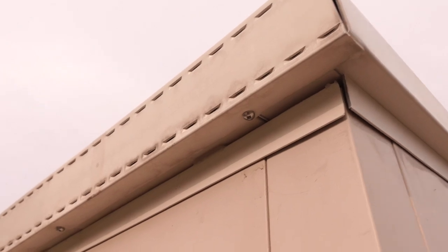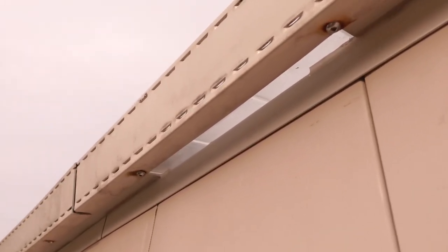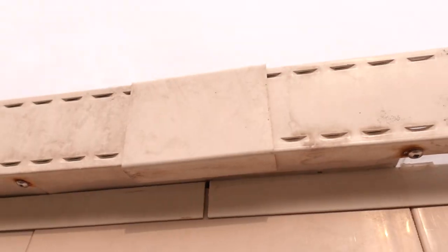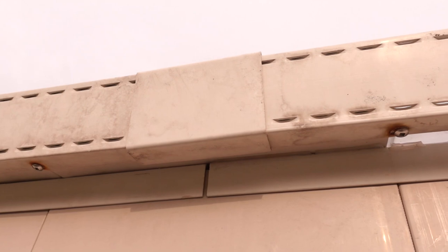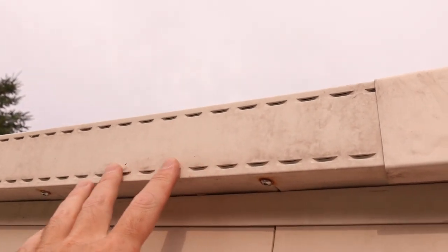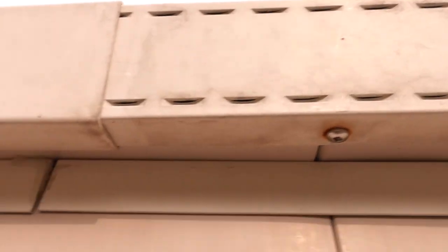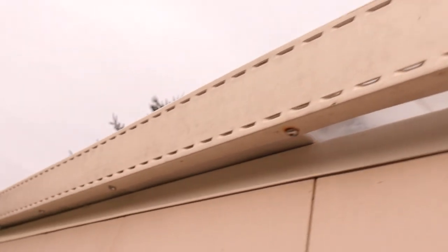And that's all done now. So yeah, that's pretty straightforward. They don't need any real sealing. And then these caps just slip over top like that, and that's about it. Again, these are weeping holes. You want to keep them clear. I got another piece that goes over there. Set of screws along the bottom, set of screws along the top.